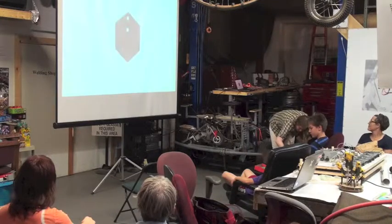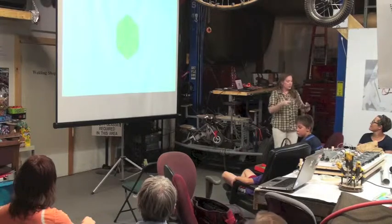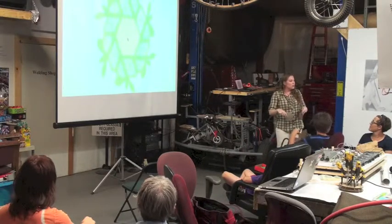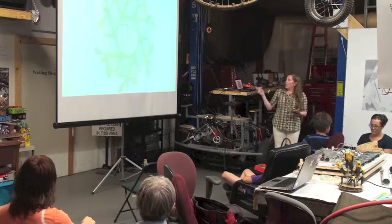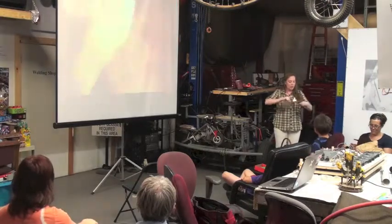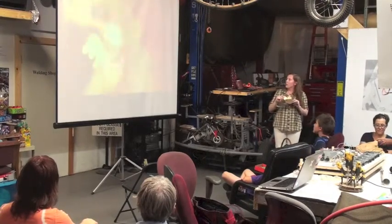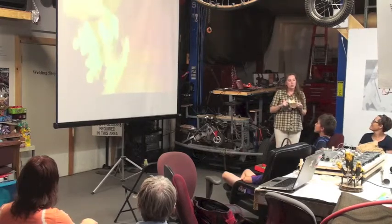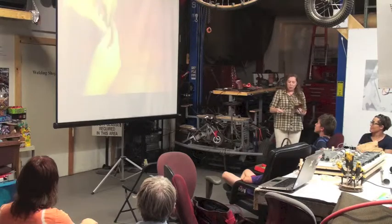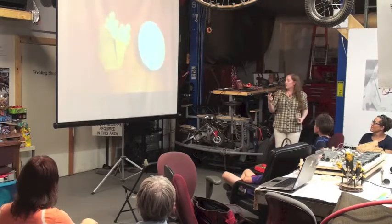One thing I also cut on the laser cutter to help put it together were these acrylic forms, so that when I was folding I'd have something to fold around to make it easier. And you'll see once it starts assembling, the intermediate steps go together with tabs and holes. But the final layer I thought I should glue, so it'd be less likely for other pieces of mail to get caught in there. And putting this piece of plastic in there gave me something to press against when I was waiting for that glue to set.